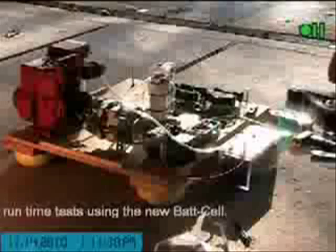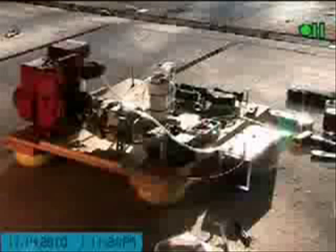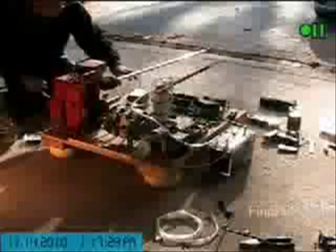I'm going to take my exhaust extension tube and shove it in there, which makes it run a lot quieter. This is just a piece of half-inch inside diameter aluminum tubing that happens to fit just perfectly right in the outlet of the muffler.